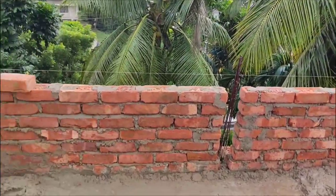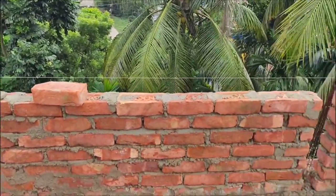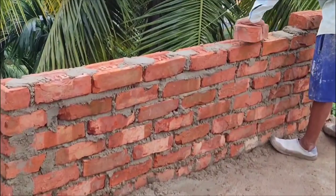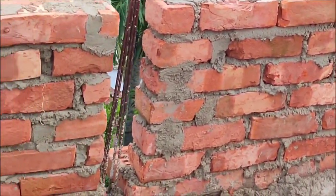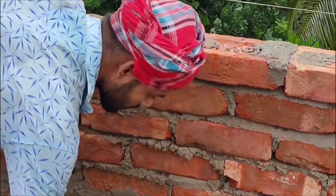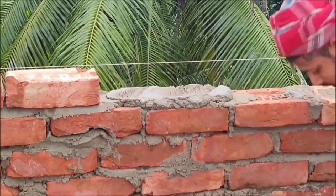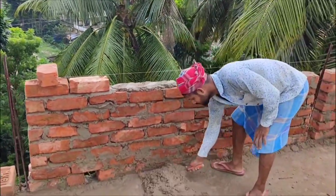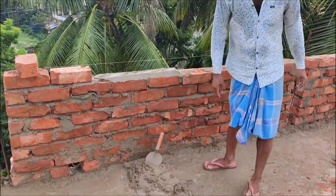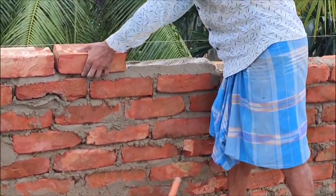This man is doing brick work, but some defects are there. Brick work should always be done standing outside the wall, so that the mason can completely fill up and finish the brick joints properly with the mortar. Otherwise, there will be a high possibility of rainwater soaking even up to the inside of the wall, though there is plaster on the outside. It should always be done from outside. But for convenience, he is doing it from inside, because this parapet wall is at the fifth floor of the building. This should never be done.